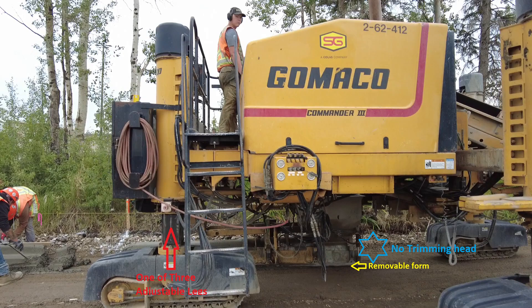In front of the word 'adjustable,' you can see one of the three hydraulic orbit motors that propels the Gomaco. As a grader operator, I want to talk about the blue star that I drew under the Gomaco. The blue star represents a potential trimming head that isn't there. The concrete crew has made a decision not to use the trimming head on this site, so it is up to the grading crew to adjust this 63mm base within a centimeter or so.